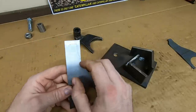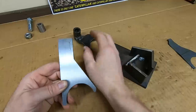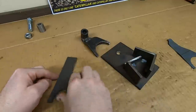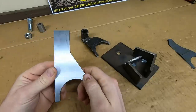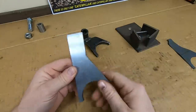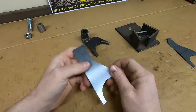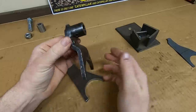We're still plenty big up here. I like leaving plenty of working room material in place so I can decide where to best locate this tang, rather than pre-cutting it and painting myself into a corner trying to work around the existing shape of the blank. The next thing I need to do is mark out for the two bends that need to go onto it. We need to replicate those two 45s to get our offset.